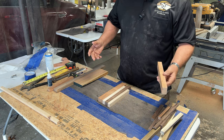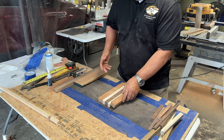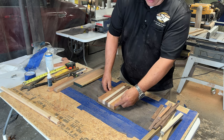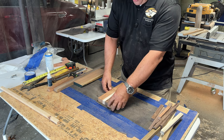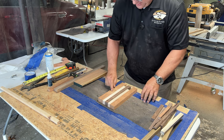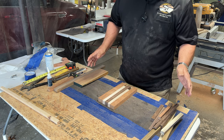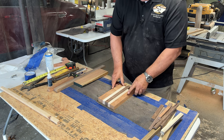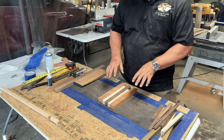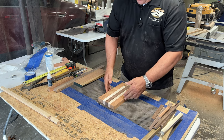You can go a little thicker if you want, and I've even made them down to a half an inch, but three quarters is a really good size. Keep in mind that after we glue this up, we're going to be planing it off just a little bit, so it'll drop down slightly less than three quarters. What you see here is cherry, maple, black walnut, maple, and cherry. The outside piece is just a little wider than the inside piece — and that's okay. It doesn't have to be exactly perfect. We'll make sure everything's planed and jointed, then glue it up, put it back into the planer, get it nice and flat, and move to the next step.